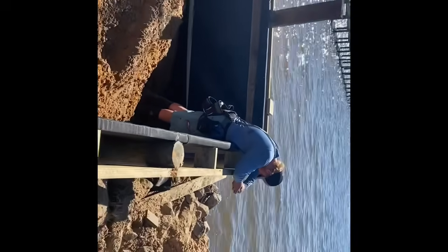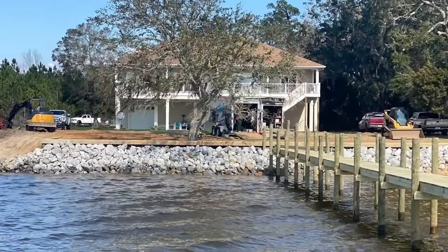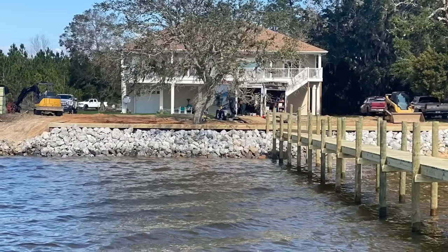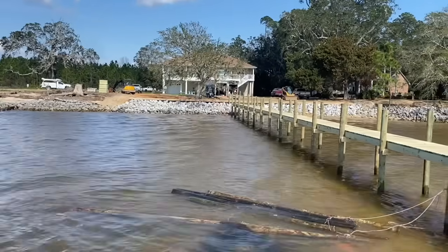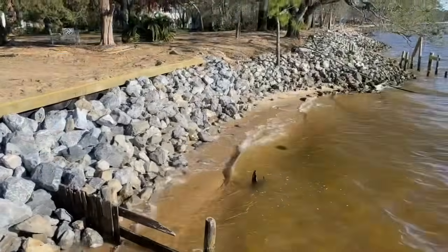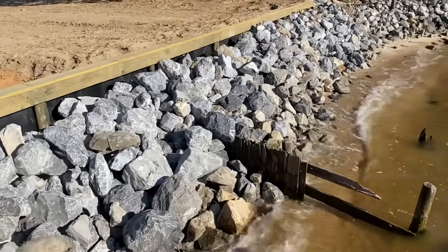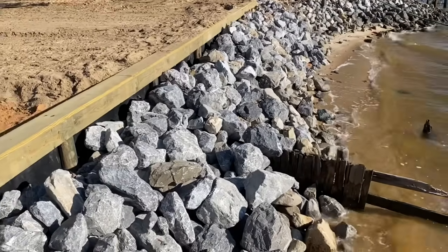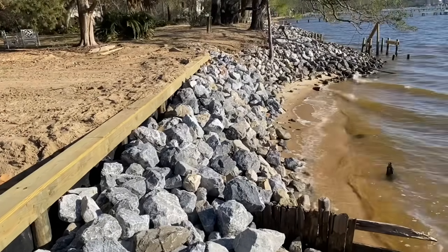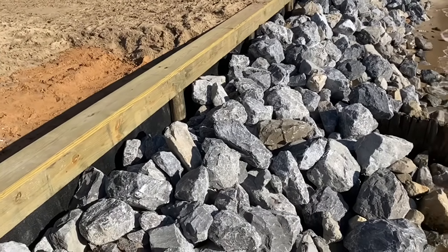Like I said, it's not really a wall — it's just a way of holding the filter cloth in place when you stack the rock against it and bring your dirt up against it. It gives you a nice defining edge between the rock and the dirt. We've got 54 tons of limestone installed along the shoreline here, up to the retainer wall that we built. Looks real good. There's complete pictures of the retainer wall — what I like to call a poor man's seawall. It's an economical way to hold the filter cloth up on the rocks, so you've got a defined edge between the rock and the dirt and it doesn't all wash down. It gives you a nice even edge for a grass cut, with the filter cloth nice and tight and three layers of filter cloth behind the shoreline.